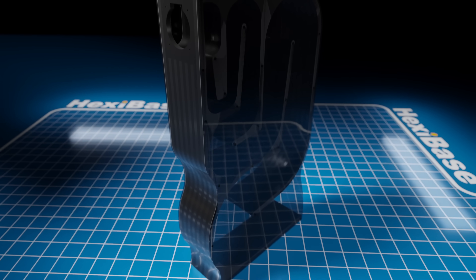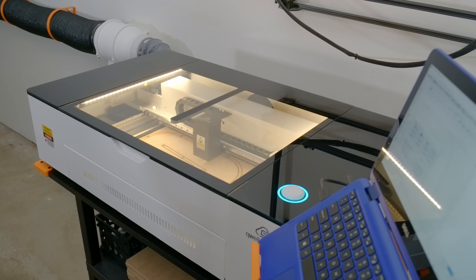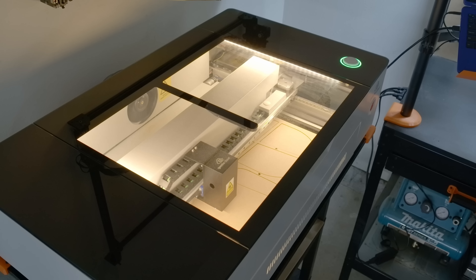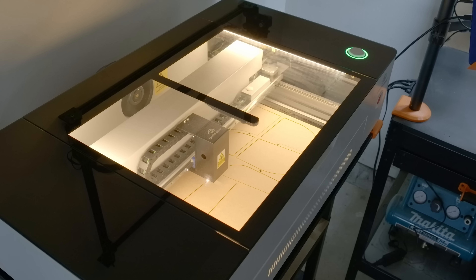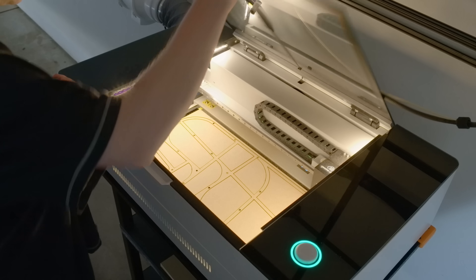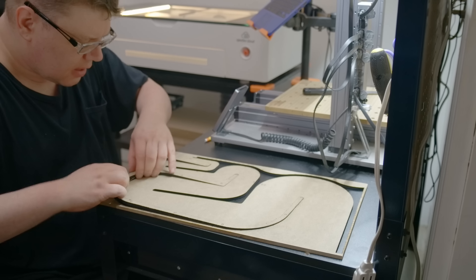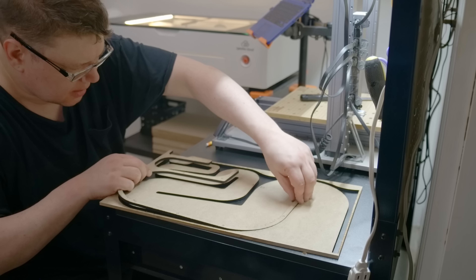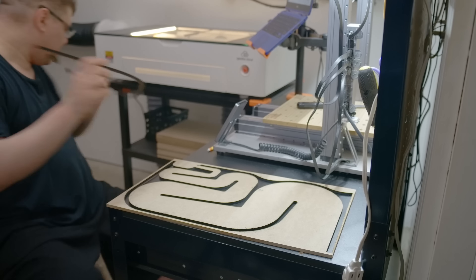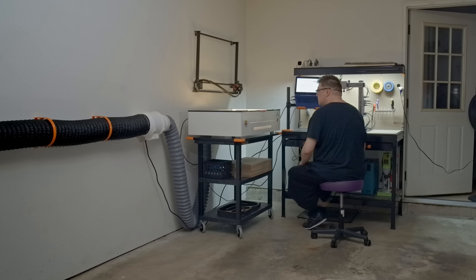Shall we begin? I already did. For an even cleaner finish, I decided on two passes per cut. With a fully motorized laser head, I can automatically run the first pass, drop the focal point, run the second pass, and still complete as many as three sheets per hour — making something like this actually doable as a weekend project. The machine has proven extremely reliable with unrelenting consistency from one toolpath to the next, further alluding to its industrial pedigree, and the fact that it doesn't even impinge on my limited work area speaks volumes for the overall form factor.